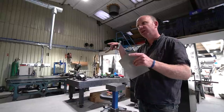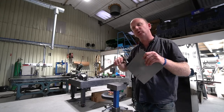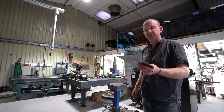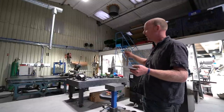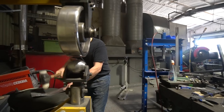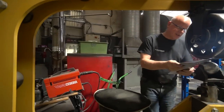The direction is because of the diameter of the rollers. If the rollers were the same diameter it would be a 50/50 guess as to which direction the steel would grow. But because the bottom anvil roller is smaller on the English wheel, that's the direction the material curves — it's more likely to curve over the smaller roller because of the way the material deforms. So that's the principle of stretching material using some form of crushing action: the English wheel to pinch it, or hammer and anvil to pinch it.